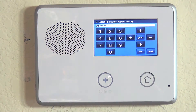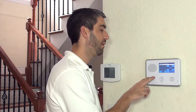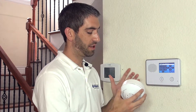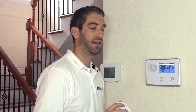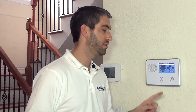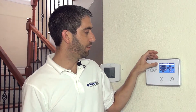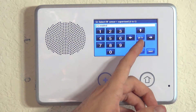Hit the down arrow to lock that in. We're asked if we want to send alarms from this device to the central station — that's what reporting means. We are monitored with this system, so we do want it to be reported. Hit the down arrow. Now we're asked whether or not we want supervision enabled. Supervision for this detector will alert us to low battery issues and range issues. So if this was borderline range and something environmentally changed, instead of finding out after there's a fire and it never triggered, with supervision enabled you would know in advance that this dropped off the network. Similarly, if you had a low battery event, instead of only knowing once the detector is dead, we will know in advance so we can pop the cover and put a new battery in. Always recommended to have supervision enabled on your wireless protection devices.